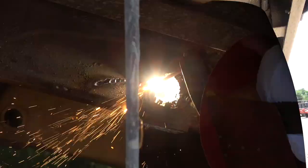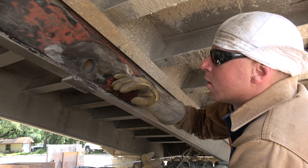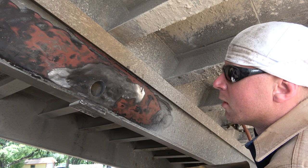So in our last shot, we just gouged everything out and went back through with the grinder and gouged a little bit more — took out all the porosity, there's none of that left. Welded everything up. We found a lot more after we got a little deeper into it that needed to be repaired, especially in this zone. Then welded everything up and sanded it all down.